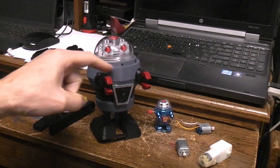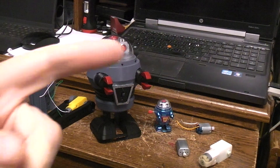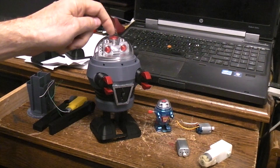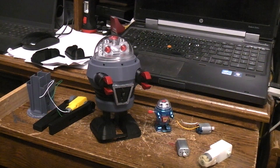I'm printing the parts for the body in a translucent red filament, which is a PETG filament, because I wanted to see how the Bambu Labs A1 Mini would handle PETG. So far it seems to handle it really well — the eyes in this upper part are already in PETG — and I'd like to do the whole body in that kind of translucent look.